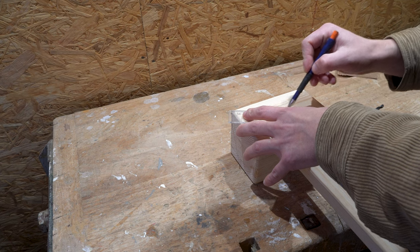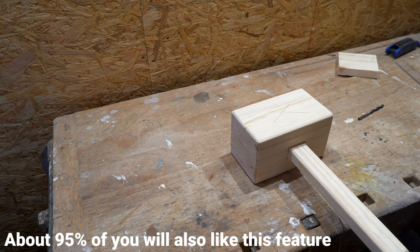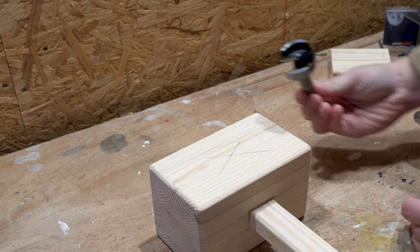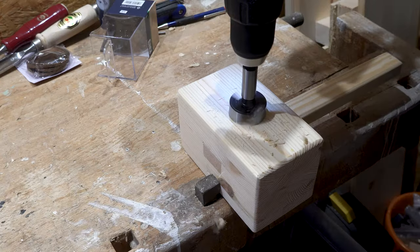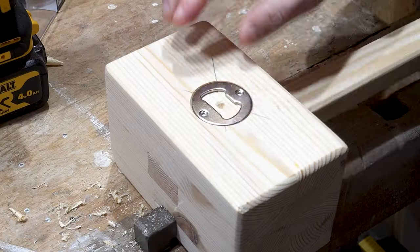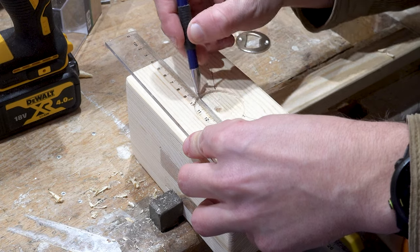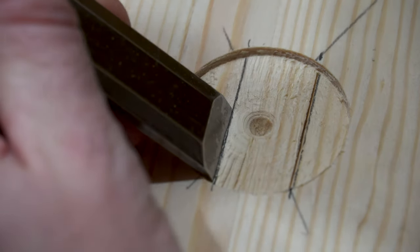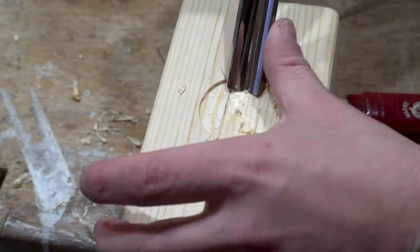To make this mallet even more useful I'm adding a feature I will find very useful in addition to being able to use it when chiseling or joining furniture. This function is self-evident for me. To drill the hole I use a Forstner drill bit which is a hair larger in diameter compared to the bottle opener. In case you also want to build something similar, everything I use can be found in affiliate links in the description of this video. To make room for the bottle cap I removed some material with hand tools — I could have done this with my router and a router bit, but viewers like it when I use a chisel.